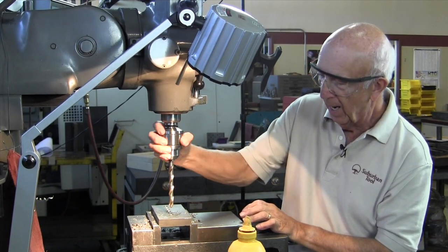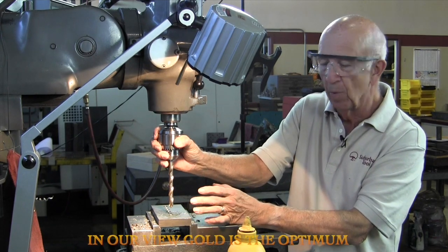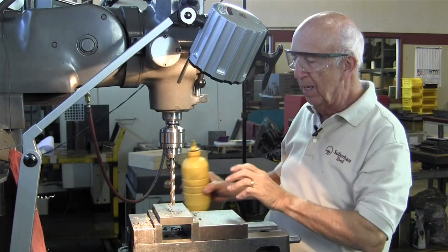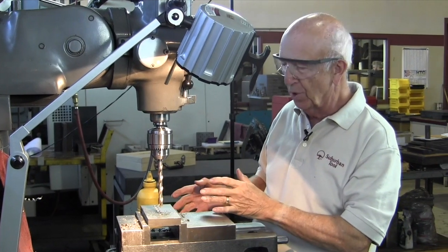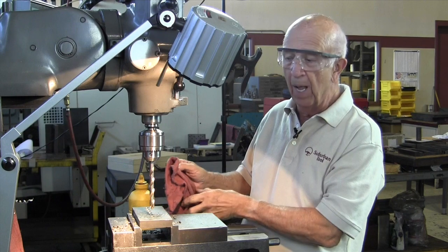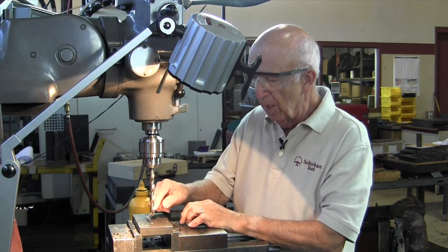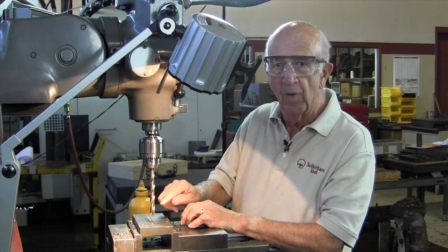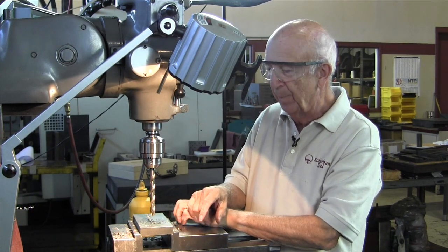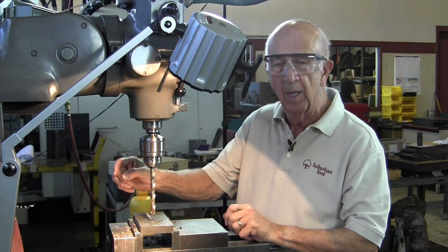The drill bit is still sharp and I don't see the bottom of it being burnt. When the bottom is burnt, that means either the drill is dull or there's too much pressure — you're removing too much stock. So it's never a good thing to see the drill bit get blue. That gives you an idea of the difference in what it takes to cut with cutting oil versus without it. You probably noticed it was a lot quicker to drill the hole with cutting oil, and it not only lubricates but keeps it somewhat cool. It's going to be very, very hot when it's blue like that — upwards of several hundred degrees.